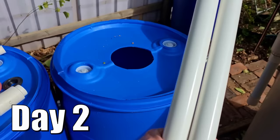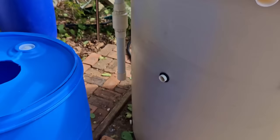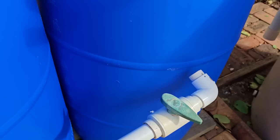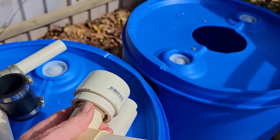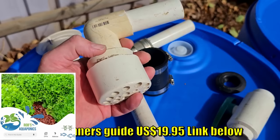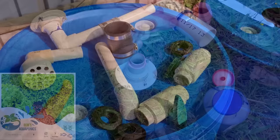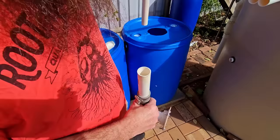It's a new day - had to go and pick up a few bits and pieces: some more 1-inch or 25mm pipe and also some new glue to glue a few of the fittings together. Just to bring you up to speed: these barrels are now ready for their base drains and a bleed-off line. This one here for the radial flow settler - we'll get to that today. We'll also be using a cuff to join the two barrels together and installing these fittings, which is what I need the glue for. Time permitting, we'll get this drain plumbed into the radial flow settler.